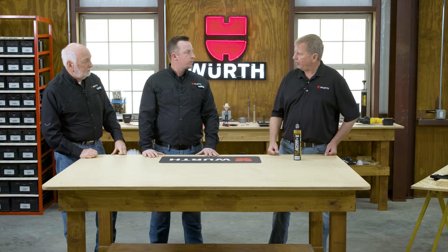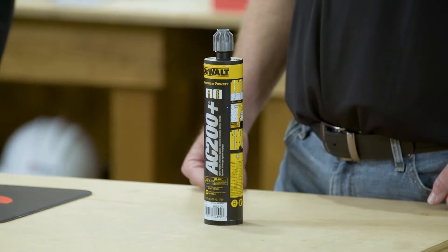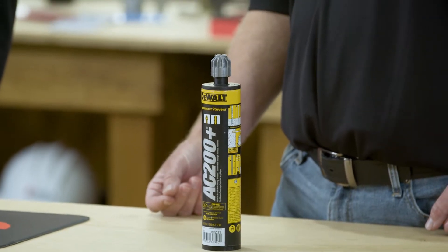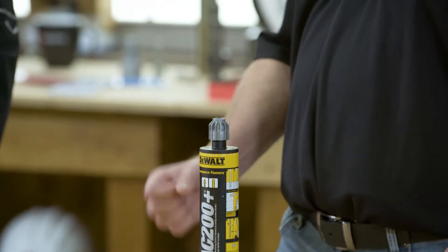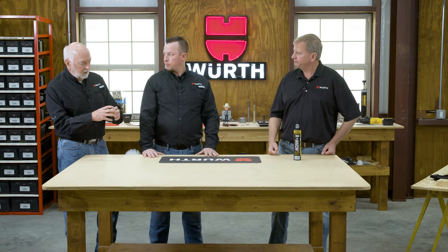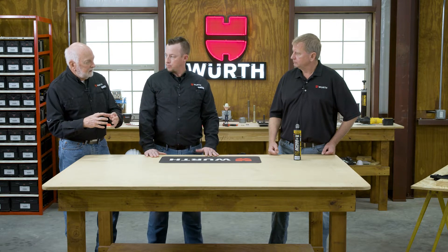What is the adhesive? It's a two-part epoxy. What you'll have is a single tube or a double tube, and then you'll have a nozzle which will actually mix the chemical. Then you put it in after you clean the hole. You're going to put it in the hole and then put your fastener in, and then let it gel and cure. So we end up putting an epoxy in the concrete hole.